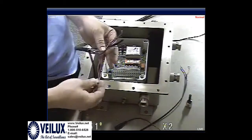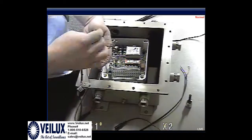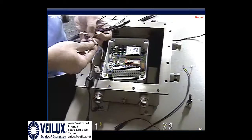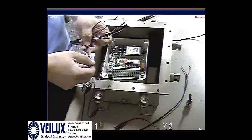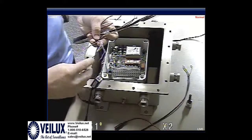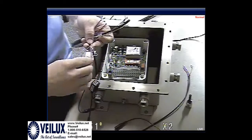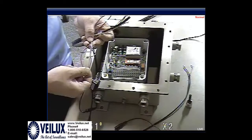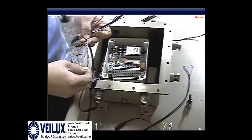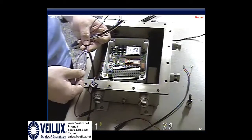But I've right now got an optional, I'm running it to a different power supply. Now, we've noticed here we have a thin plastic sleeve right here. This thin plastic sleeve that is clear with these 4 wires, one is the power for the camera. And then as we looked on the side of the camera earlier, it said the thin brown was common, and then the thin green is positive RS485, and the thin blue is negative RS485.